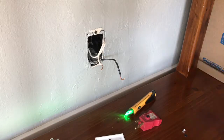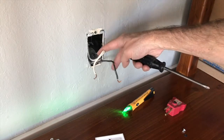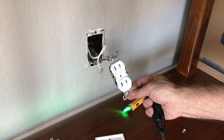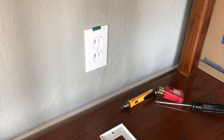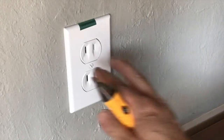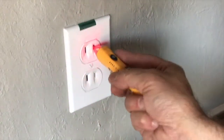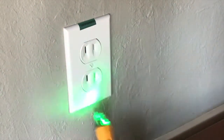There's the original wiring from the house. Because this was not part of a remodel, it's totally adequate to have two wires and not a third one for ground. We're replacing the old receptacle with a two-prong ungrounded one — we've labeled it 'ungrounded' as well. Power's back on. Since this is a two-prong and not three-prong, I use the Klein voltage tester instead. Put it in there — it's hot, and we're good to go.